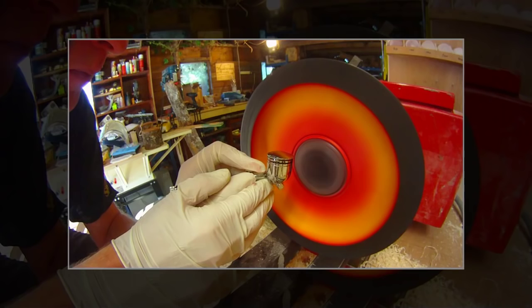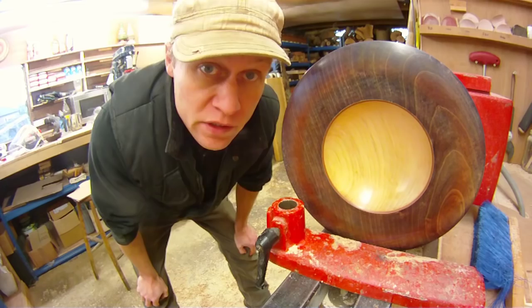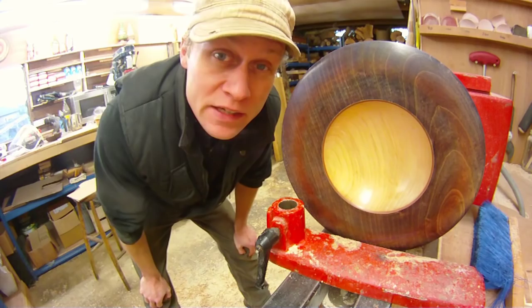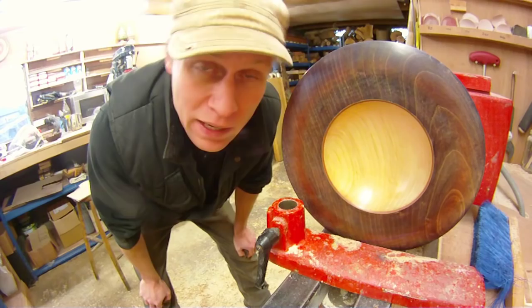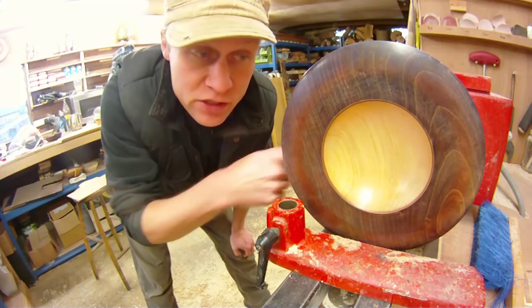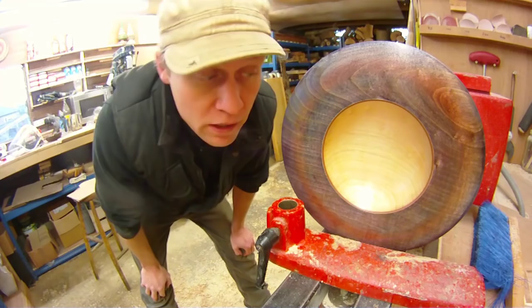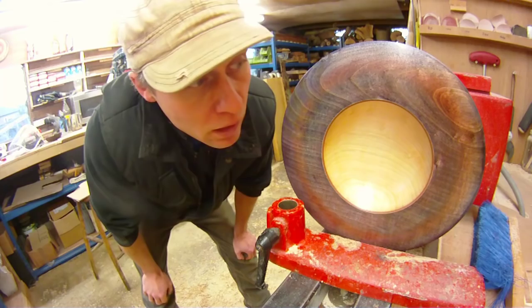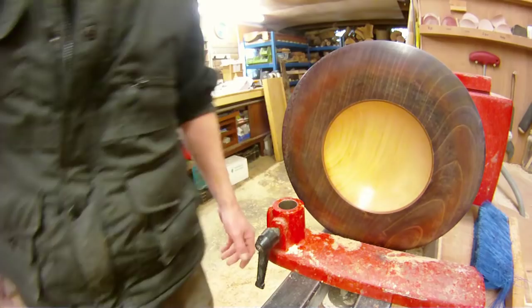But what's this I hear you say? A finished piece? Well it is kind of finished. I coloured it and stuff and then I thought I'd be clever and lacquer it. But I didn't add any sanding sealer, and so then I rubbed the lacquer back and tried to finish it but it just hasn't come up how I want it to. So I'm going to start the rim again. I'm going to take all the colour off and any remaining lacquer I haven't got with wire wool, and do it again. I'm a perfectionist and if I'm not happy with it, I'm not happy with it.